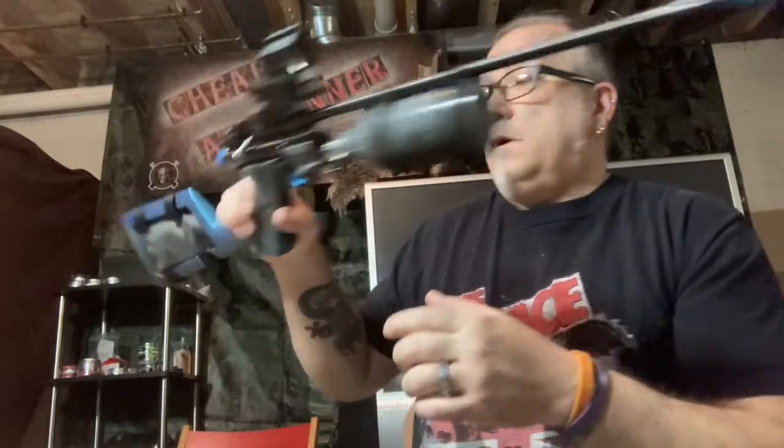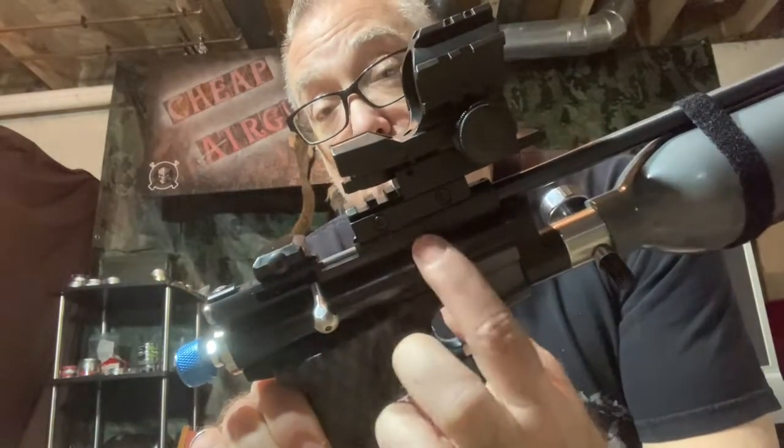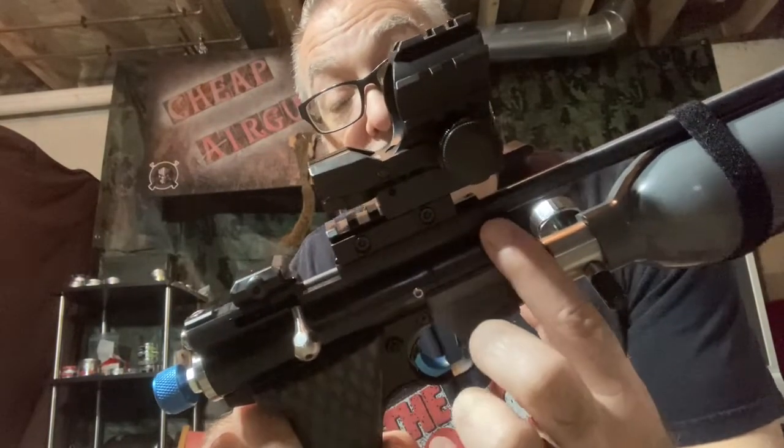For the time being I figured I would take some RTV gasket maker — Permatex — and put a light coating along the underside of the breech. I also put a ring of gasket material around the outside of the transfer port that sticks up out of the hammer tube slash valve tube, running a thin coating from the transfer port up to the front of the breech, and reattached it.